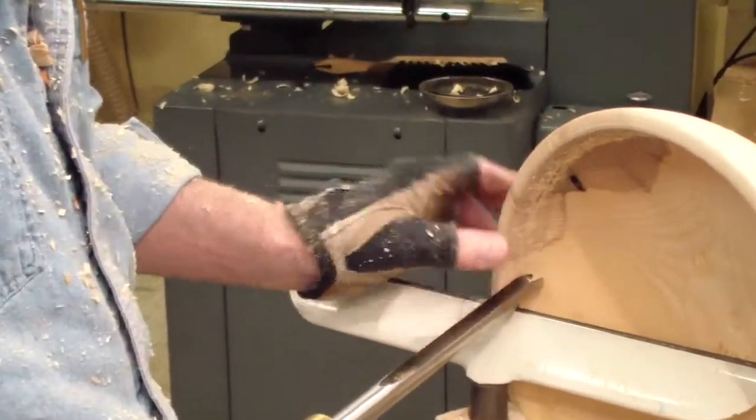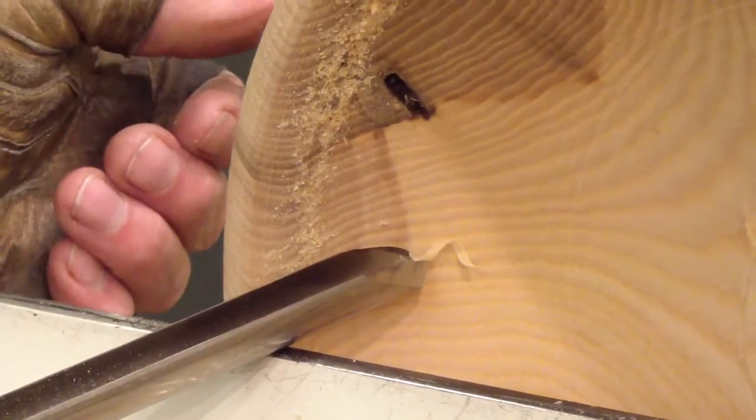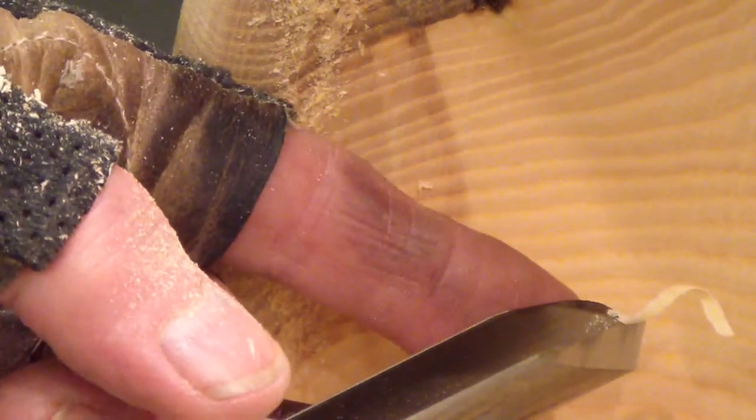What I do instead, for the first time of all the cuts that I've showed you, is I use the bevel, but I do it in a way that allows me to use the tool horizontally now and engage, clean this up, the left-hand side of the tip for the first time. So fundamentally what's happening is here, down below that edge, the bevel on the left-hand side is exposed just enough from the sharpening jig that I've got something to ride here. So I engage the bevel, and then I rest the bevel on the wood, and then I engage the tip of the tool, the edge of the tool, and I progress on with the cut all the way down into here, riding the bevel the whole way.